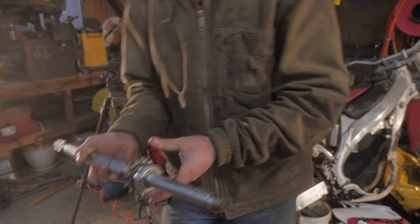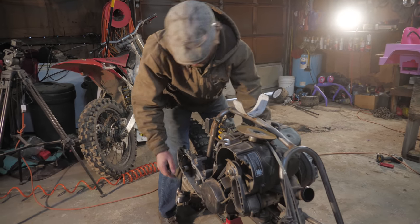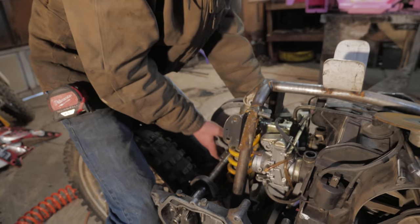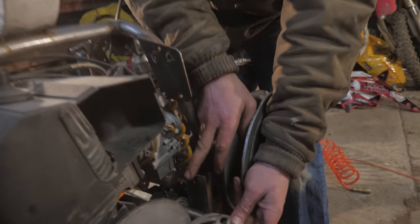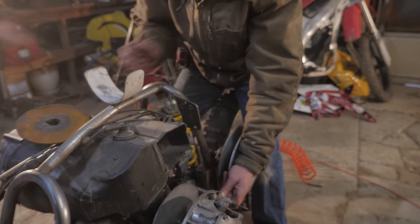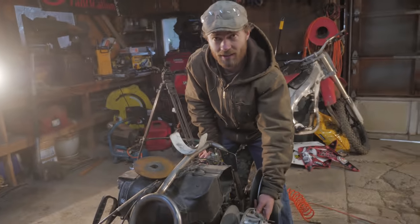The bearing fits on there. Now that takes care of two of my bearings and the lubricated chain case all in one. Then all I need is to mount this bearing, which is a good bearing. I just have to mount it, modify this mounting bracket, and put a new bearing there. And then chop the shaft off here wherever we need it, and we'll be kind of back in business.